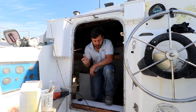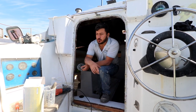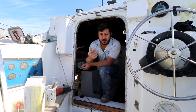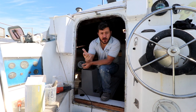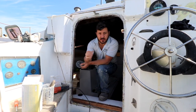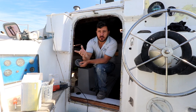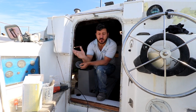If you want to build yourself one, polycarbonate is not the most cost-effective - you could go for Perspex, which is sometimes cheaper. We went for 10mm clear polycarbonate. The reasons we chose it: it's light, it's clear obviously, and it cannot break. If anyone hits anything against this panel, toughened glass is tough but if it gets hit in the wrong spot it's completely shattered and you can't fix it. In the middle of the ocean you're not going to have a replacement for two to five weeks. With polycarbonate, if I can just find a supply I can cut it myself, shape it and fit a new one - though it's physically impossible for that panel to break.